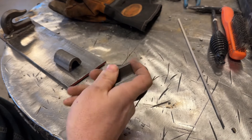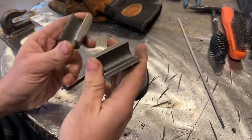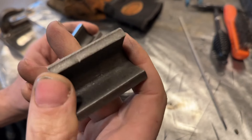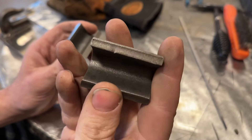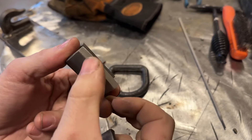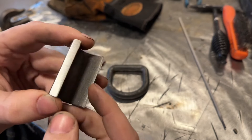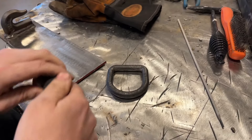There are a couple things to concern yourself with. One is you want to prep this stuff. You can see here where it's just a forged loop that comes with scale on it. Buff all of that off - the ends, the sides. The inside doesn't matter as much because you won't be able to get a weld in there anyway, but you can buff that too. You want to prep it.